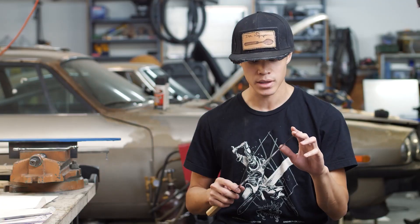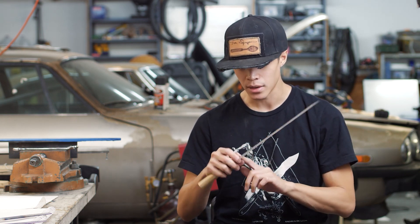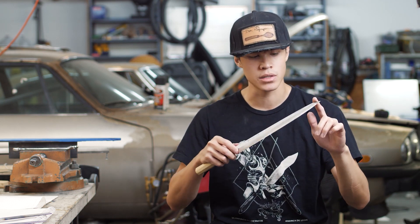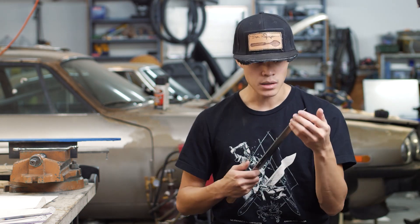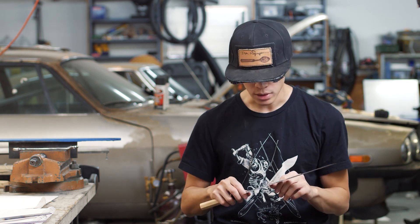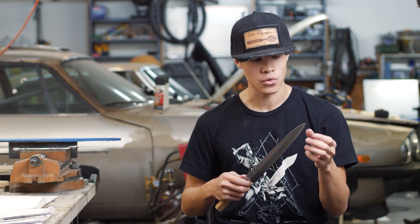The second problem I'm facing is warp. Most knives I do are pretty symmetrical and you can deal with warp in a few ways — one is just grinding it straight, but you can't really do that here because of the asymmetric grind. These are made a few different ways; this one is the more common clad construction with soft steel on one side and hard steel on the other, which is done for ease of straightening and maintenance. With the soft steel you can tap it with a mallet and bend it straight. I can't do this because I don't know how to forge weld this type of construction — it's a skill that takes years to get comfortable with. So I have to do mono steel or differentially hardened steel, which has its own warp correction issues.